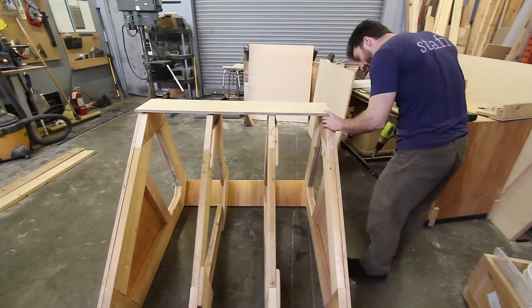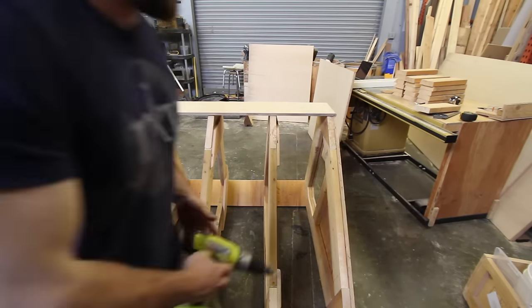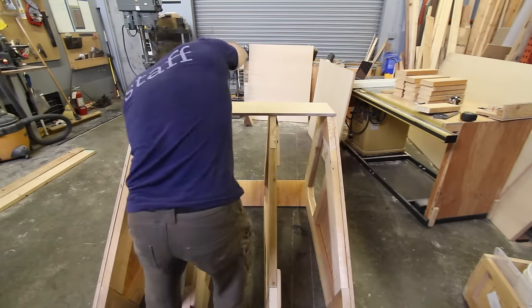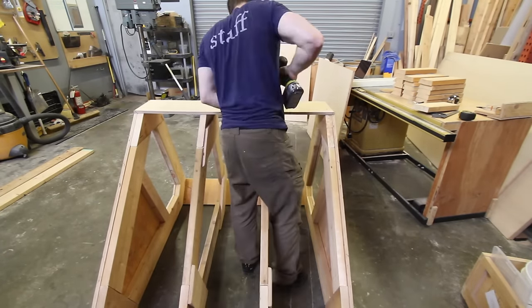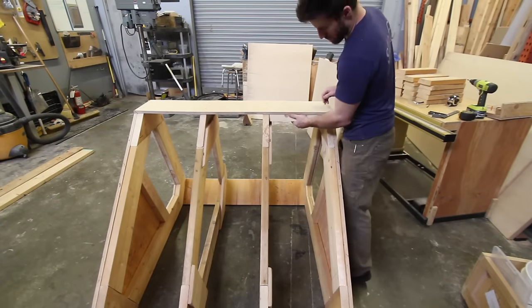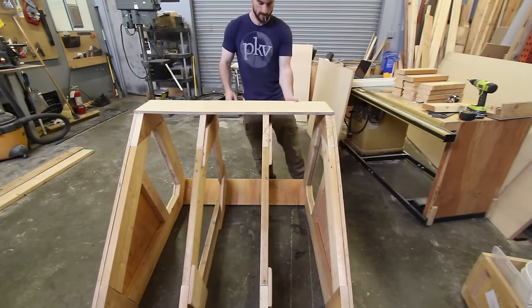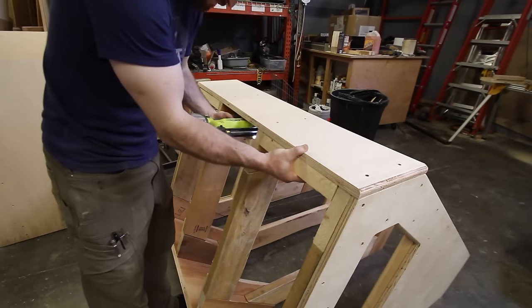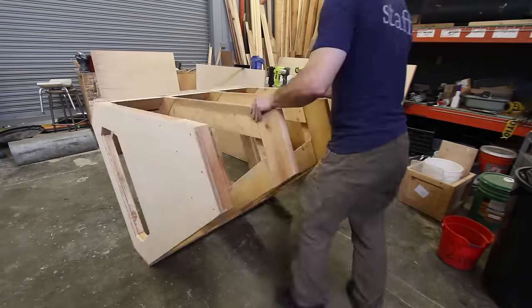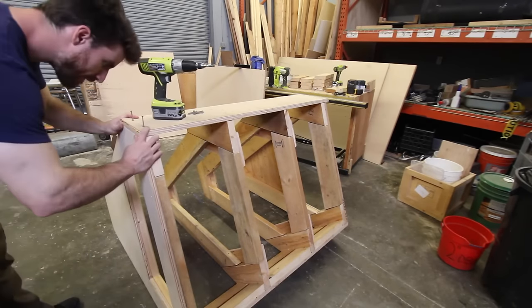Putting in the other side, pushing these frame pieces into the right spot — sometimes hammering, sometimes holding temporarily with a screw and then moving it around to get it into the right spot. Checking that the blocking pieces fit — you can see them all cut up there on the right. Some of these I had to trim down. I ended up screwing them in from the top, and that was the primary way they stayed in.